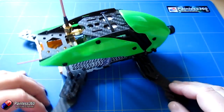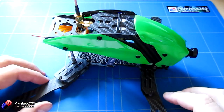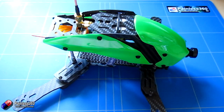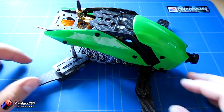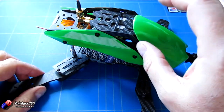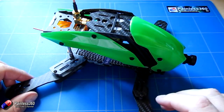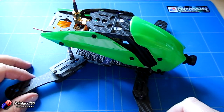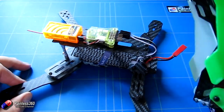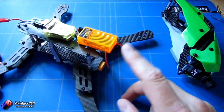We're going to add the FPV system, the control board and the receiver. Before we get to the ESCs and motors, I want to give you a few tips on how to think about this build. I've put a lot of thought into the best components for this frame — although it appears roomy, a lot of that space is for the battery. I'd work on it as two components: the top part as the FPV system, and the bottom part as the flight controller and receiver.